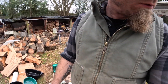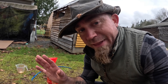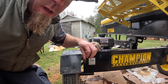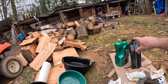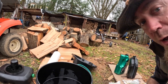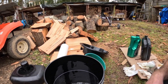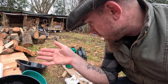Instead of keeping the leftover half-gallon in the bar-and-chain container, I poured the balance of the fresh hydraulic oil into it, marked it, so I know where to go if I need to top off the level. For the old oil, I took all the containers of drained oil and put them into the five-gallon bucket for proper disposal. I was about a half-gallon shy — not terrible. The old oil looks darker in the containers because they had residual motor oil in them.